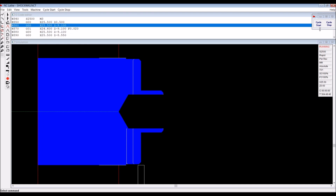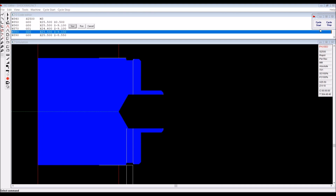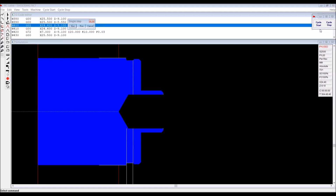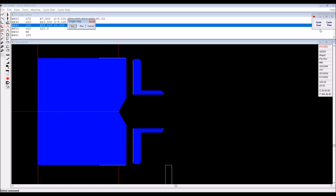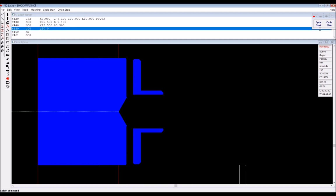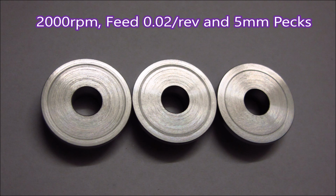Now we use the parting tool, go in a little bit, come out, go across so we can create the chamfer, and then go in a single move. No pecking, I've given that up. So that's what I was getting when I was pecking. It's one of the reasons I don't do it anymore.